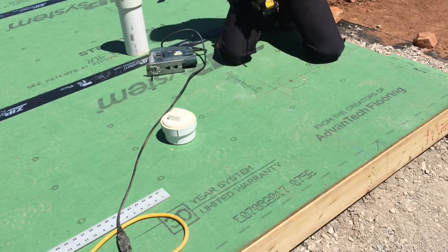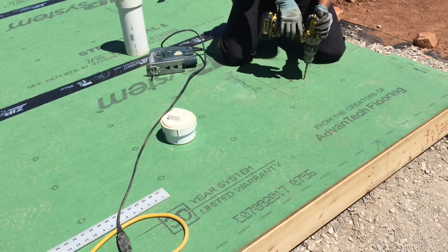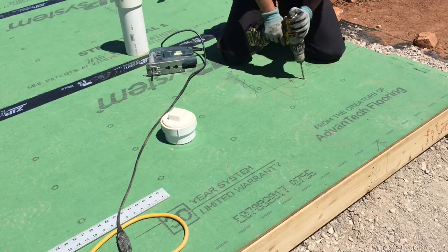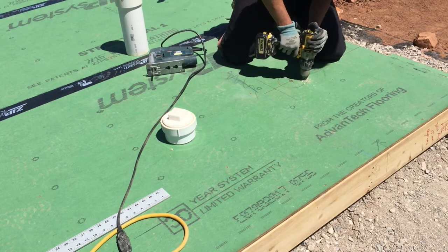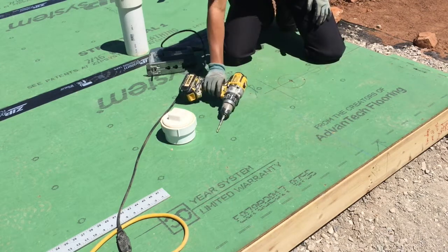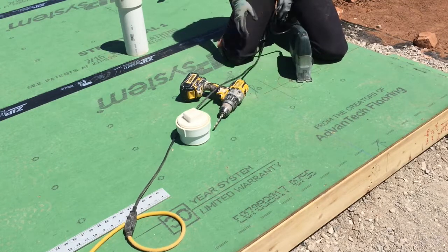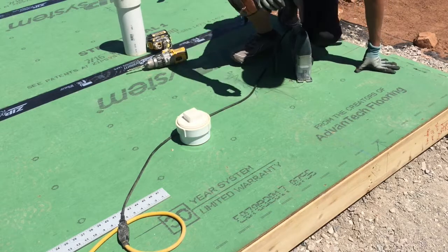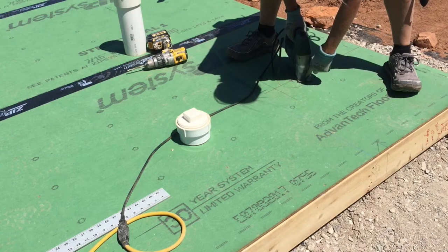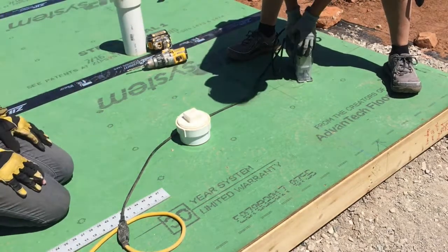So step one is to take your drill and a drill bit that's bigger than your blade, or to drill multiple times with a drill bit to make a hole that's big enough for your blade. Send that in your floor. Okay. And then test to make sure your blade fits in. Also, your blade depth might be important if you have anything underneath you don't want to cut, so just remember that for cutting. If you're using a jigsaw, it has a little guide, a little notch, a little arrow that says where you're going, so you're going to follow that. Make sure to put on your ears because jigsaws are loud.